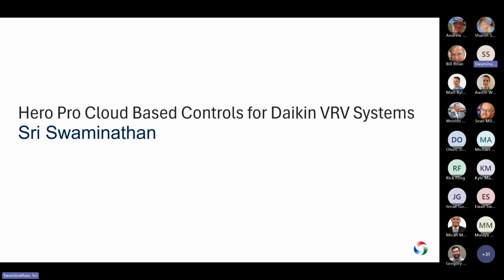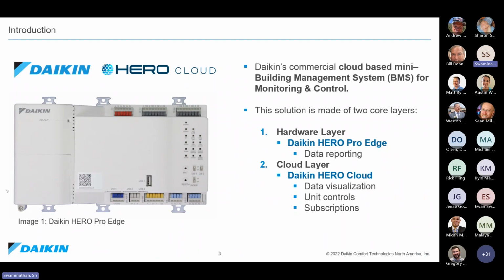Thank you, Andrew, and thank you everyone for taking the time to be part of this session. I'm Shri Swaminathan, manager of VRV controls as well as the light commercial business, and today we'll cover the Hero Cloud Pro Edge. The Daikin Hero Pro Edge is going to be a new centralized controller that will take the place of the iTouch Manager, and it will connect to the VRV system in the building. And from there, you're going to have cloud access, which is essentially remote access to all of the systems. And with that, you get trending and analytics and remote control as well to that VRV project.